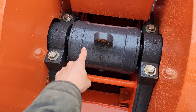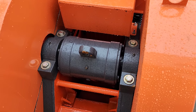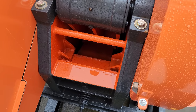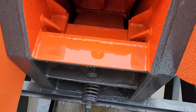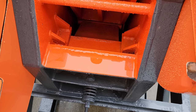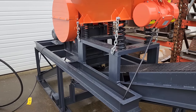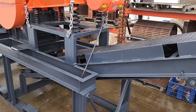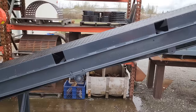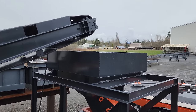There are several grease fittings that need to be greased every day, every 8 hours of runtime. And I have some other videos on YouTube about how to adjust the jaws down here you can check out. And I'll leave a link to those in the description. The crushed material drops right out of the bottom of the jaw crusher and feeds up this conveyor here, all the way up into our fine ore bin.